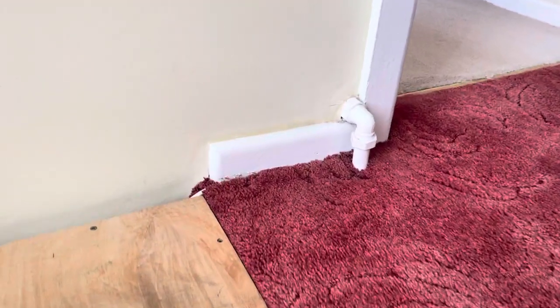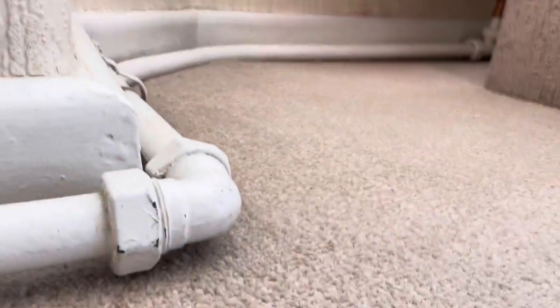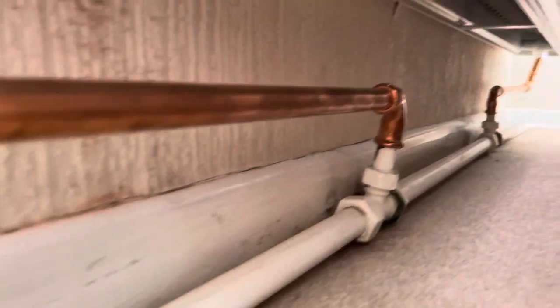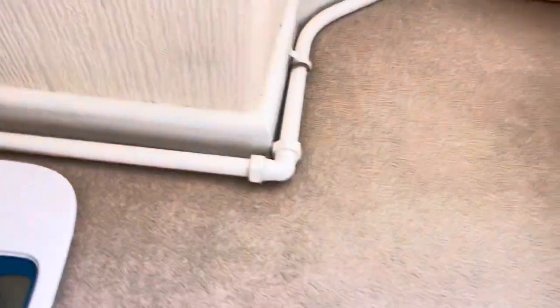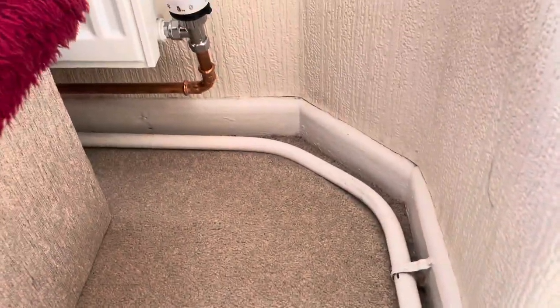You've got this lovely knee elbow - pop it up like this - it's a typical one-pipe system, and then it's behind the wardrobe. You can see it runs along the skirting board. Look how old that fitting is - it's artwork, that copper pipe going around there. They've had a new radiator put on, and it is just about working, but the old one - where the white is, where it joins - they've gone straight in, straight up, without a bend. That's breaking the rules on the one-pipe system; it won't like it.